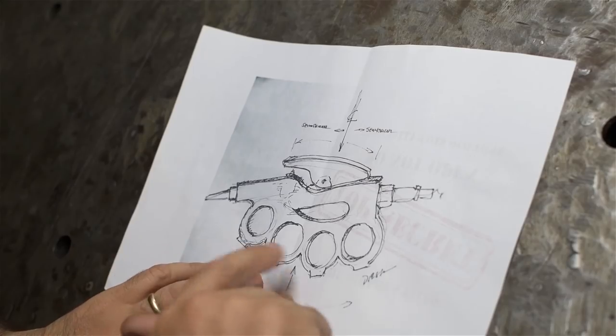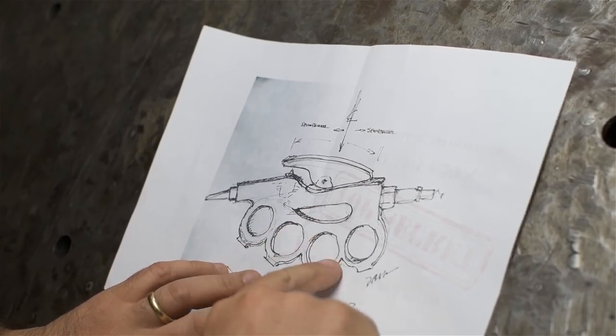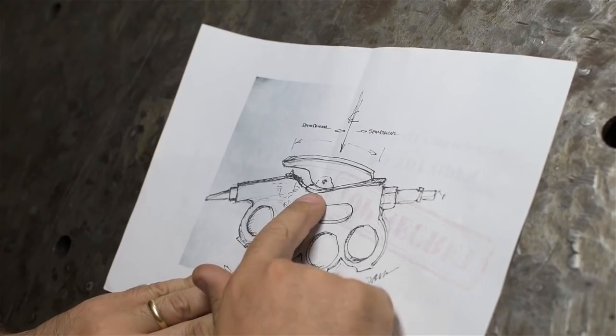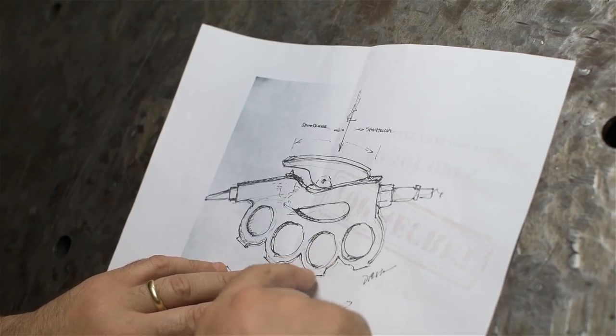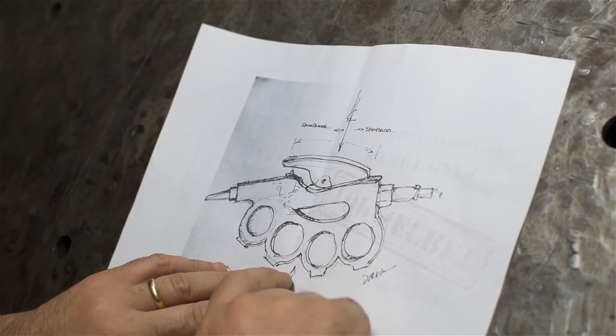We'll essentially be building this, engineering it, I suppose, start to finish, from Jimmy's hand sketch to the working prototype. This is a blowgun, so we'll need some sort of valve and valve actuator. Second, I want to keep it easily manufacturable. Now, I'll be machining this thing. In real life, it'd likely want to be a casting to save on material and manufacturing costs, but I don't really have that option here in my shop.